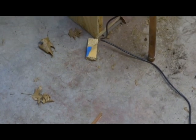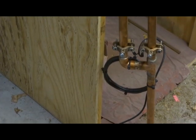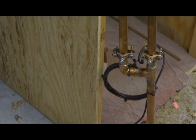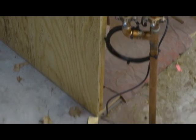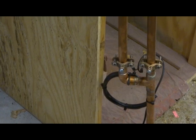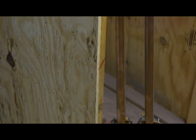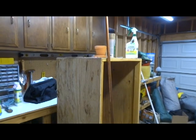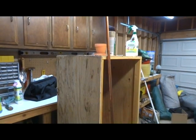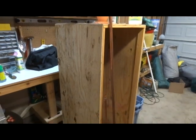You can see I still have a little length of cable left. One thing I kind of overlooked is I need to get a connector — like an SO239 or BNC — on the other end of this cable, and then it will officially be done. Anyway, this is what it looks like completed. I hope you all enjoyed this little tutorial and that it inspires you to make your own copper J-pole 2-meter antenna.